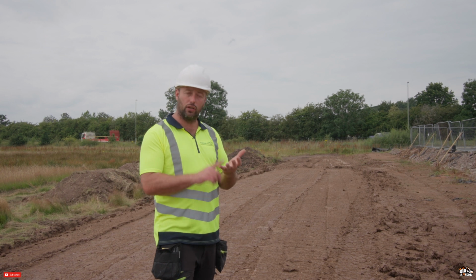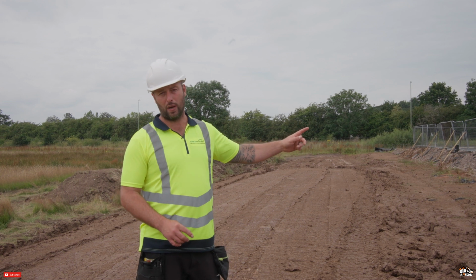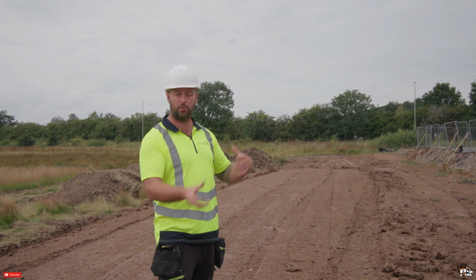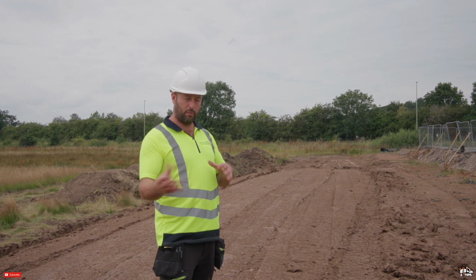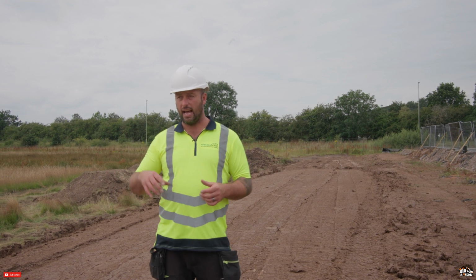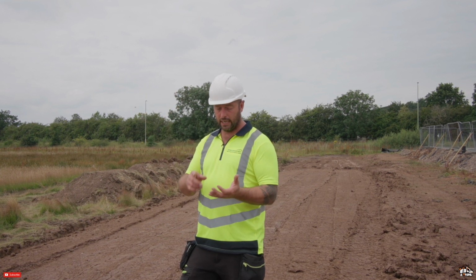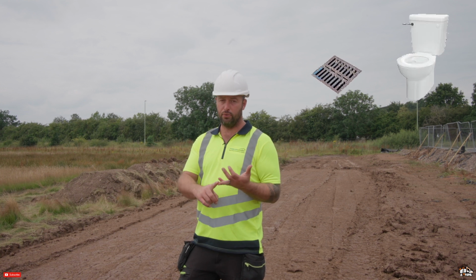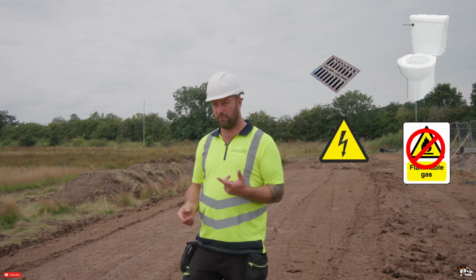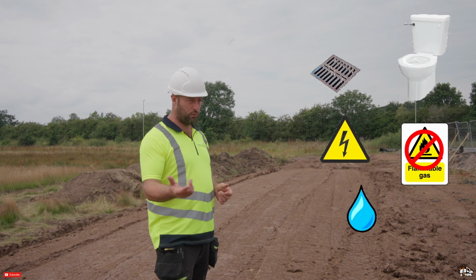And then beyond that, obviously you've got all the drainage to sort out and the ecology side, because as that's an open top swale, effectively there is a value as a wildlife corridor as well, which we're now going to block off. So we'll be putting pipes through there to take all the drainage. And of course in this new road here, every plot or building that we do thereafter on the estate needs to be serviced by surface water drainage, poo drainage, all your electric. We're not putting gas in because don't think that's the way forward, and don't think we require it on anything that we've got on site here. And then obviously mains water.